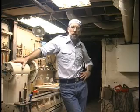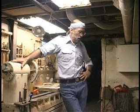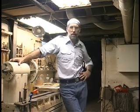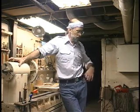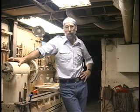If you tried to turn a big blank that was dry, it would take you a lot longer and be a lot harder. Also, when you try to dry a large blank of wood, it takes many years, and the odds of success are fairly small, because if you have a block that's 6 or 8 inches thick and maybe 18 or 20 inches square, the likelihood is it's going to crack.